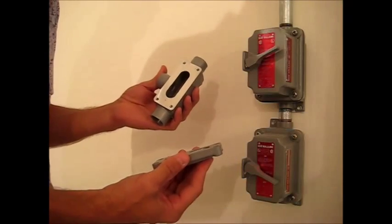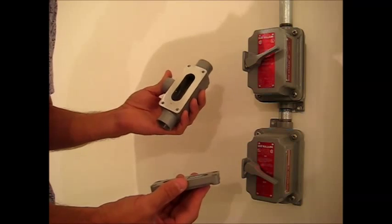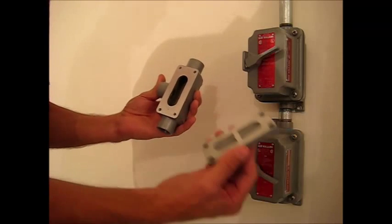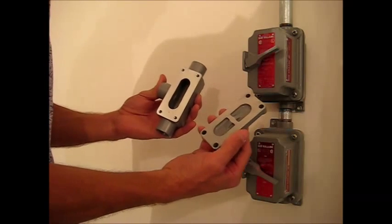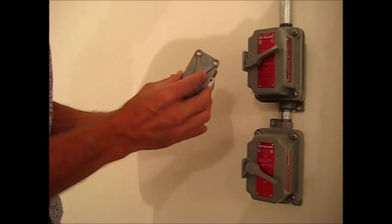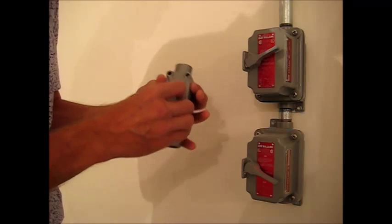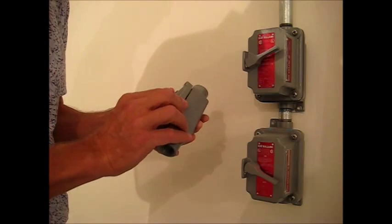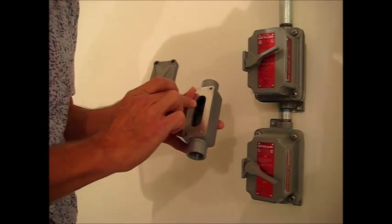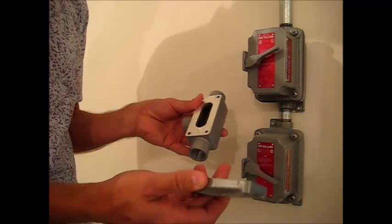Let me illustrate what I'm talking about here. This is a typical T-body — it is a fitting for the conduit to chase wires through. And this is the cover plate. These surfaces are honed and machined to a very tight tolerance, and when you put them together, they have a nice tight seal. Gases are very fine — they can escape through that surface — but there's so much surface area, so many millimeters, that as the gas travels over that surface, it's cooled and becomes harmless.